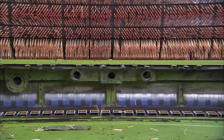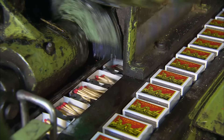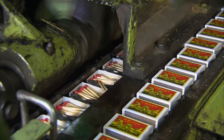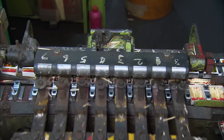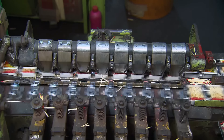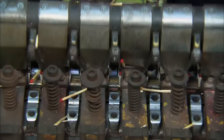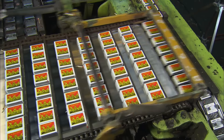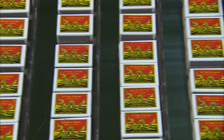The finished matches finally come off the match bar, and the filling machine places them into the liner. At this point, the machine processes 200 matches per second. The filling machine pushes the inner liner into the outer box. The machine is calibrated to fill each box with a set amount of matches, and reject the extra ones. Finished filled boxes come out onto the packaging conveyor.